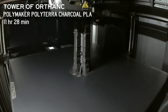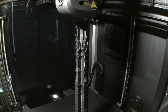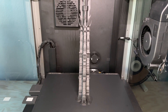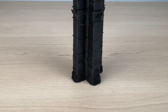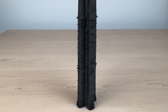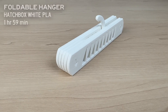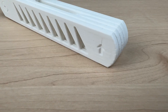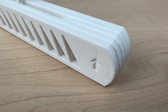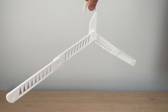After these initial tests, it was time to move on to some more interesting items. This Tower of Orthanc printed at a 0.1mm layer height took around 11 hours. I really wanted to test the bed adhesion with something tall and narrow, while also determining the resolution the printer can achieve. Besides the stringing on some of the spires, this model looks good with some very high detail. To test the printer's tolerancing, I printed this foldable hanger. Although the outer wall has the slight banding that was present in the test models, this does unfold and operate as expected.